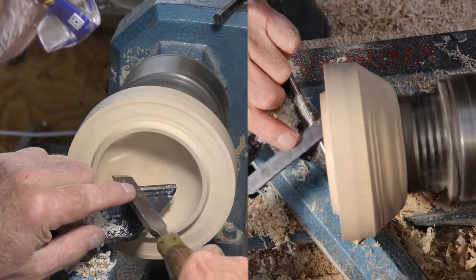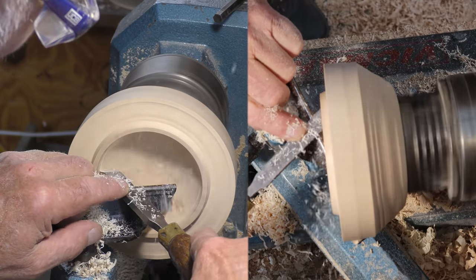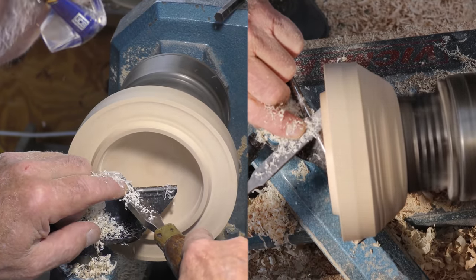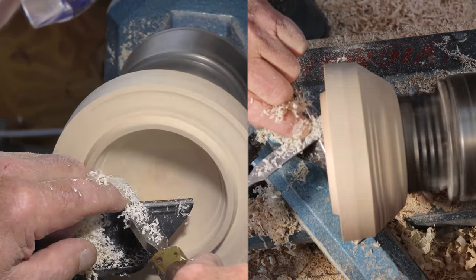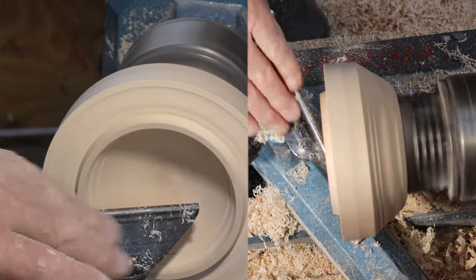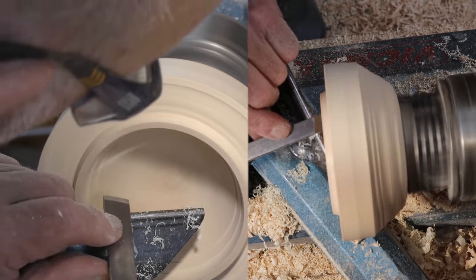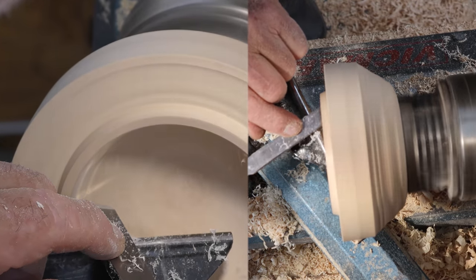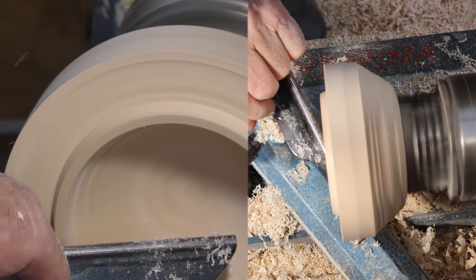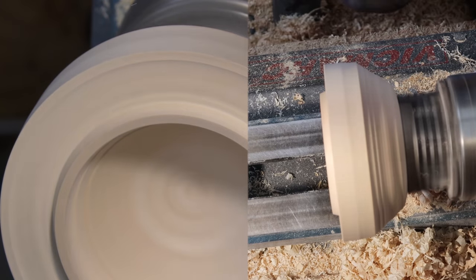just a shade. Now all I need is a good groove or two, just for the jaws to slide into. So the idea is to try to make these look decorative, so people look inside and say, oh, that's a nice little detail, but so they don't realize the real point of them is to provide somewhere for the chuck to expand.